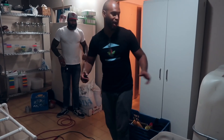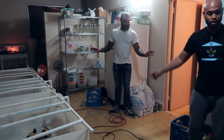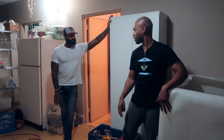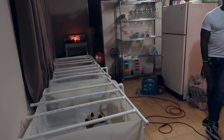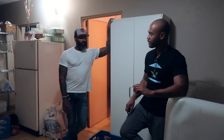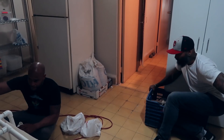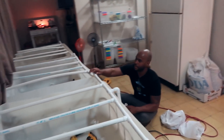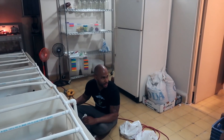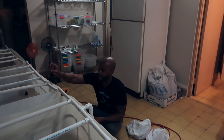We need it to come out. This is coming under gravity right here — so it's not a problem that this is three quarters and this is going to be inch over here, because this is under pressure and this is under gravity. That three-quarter inch under pressure can push out way more water than this one inch under gravity. In order to get the same amount of water from that three-quarter inch, you'd probably need like an inch and a half under gravity to match that speed. That's how you do it on all of them. Since you're not raising these beds above the fish tanks, this is the best way to do it — unless you want to run two pumps. It's unnecessary to run two 1,000 gallon per hour pumps for this type of system. It's not a flood and drain, but it still gets the job done.